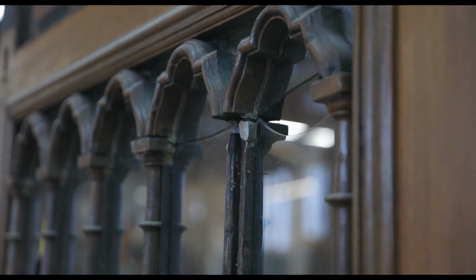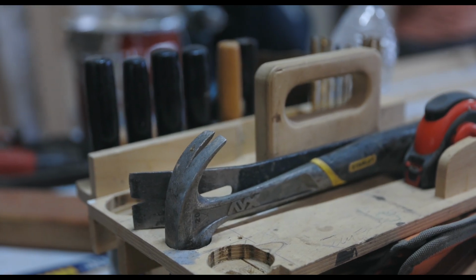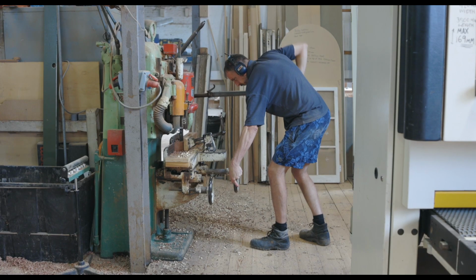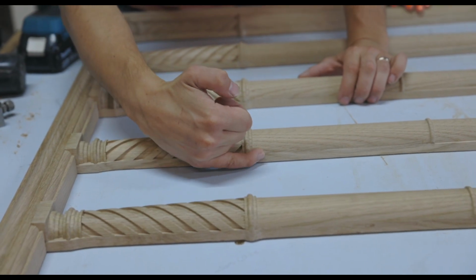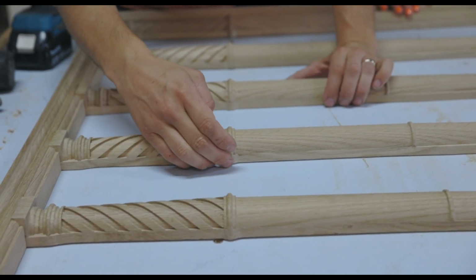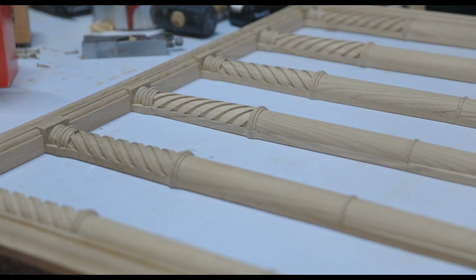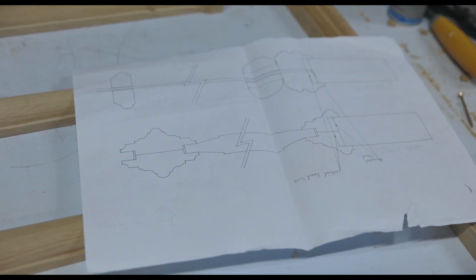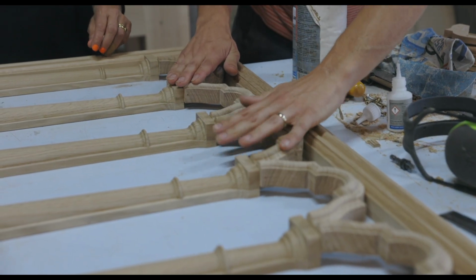These facing pieces are made in three sections, and then they fix to a solid piece of timber at the back, which is all then housed in here and screwed solid. Some of the mouldings I've finished into the backing piece. I've sort of bought into the moulding a bit more to support the back of the moulding, and I brought these all flush with this, which was easier to do where these were sort of made on a copy lathe. They're all exactly the same length. I've made it as one panel. I just think it's more robust.